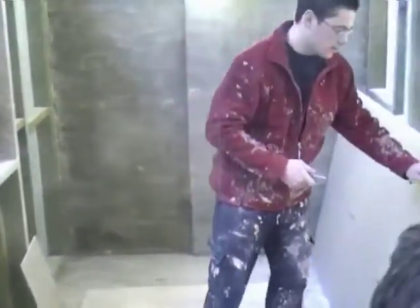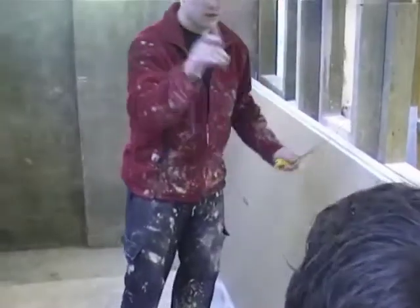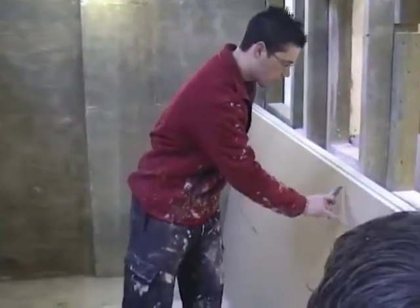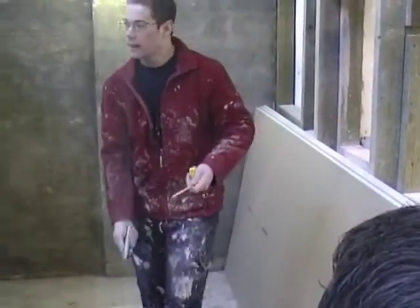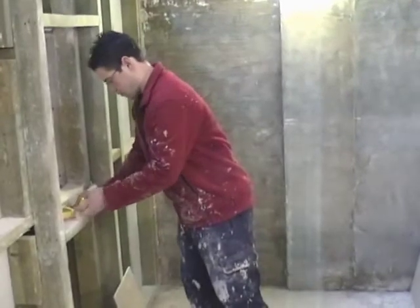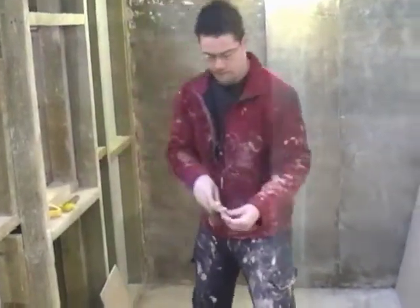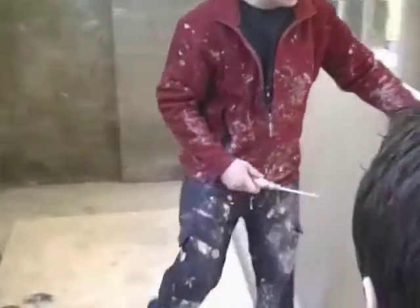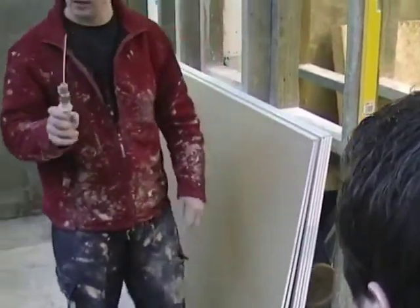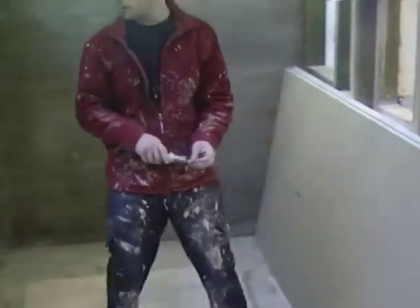Standard 9x4, holding where your level is, make sure you keep it in a straight line because it has a tendency to wobble, so just try and do that in a straight line. All you've got to do is score it, turn it round, break it and cut it off the other side. Remember cutting in any little areas — a Stanley knife won't give you a nice cut, so cut in any little areas straight away. It might take a little bit longer, but it'll give you a neat finish.